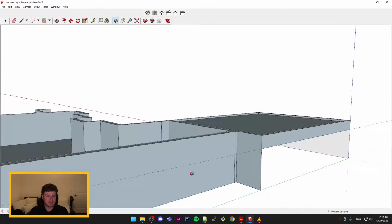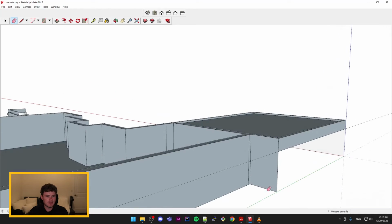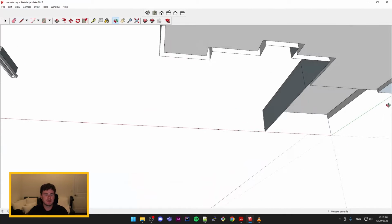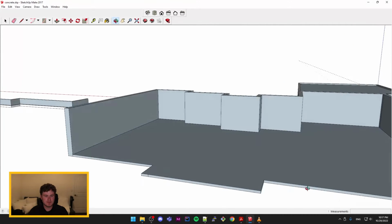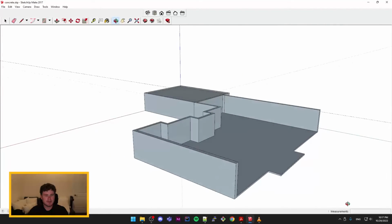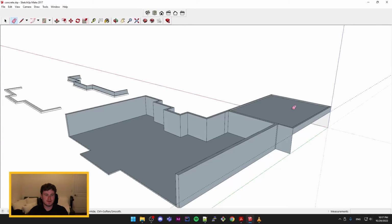And then at the very end, when we have all the concrete work done, besides the post holes, which I'll talk about here in a second, all of it should line up. So on the top, where the garage is going to be, the top of the ICF walls in the basement all should be at one level. And then we're also going to have a framed wall here. So along this edge here, there'll be just a 2x6 wall. And hopefully, my hope is that we get all of that done. So all the concrete work and this wall here and a few of the load-bearing walls inside, we get all of that done before New Year's, but I know that might be ambitious. So if we don't, I'm not going to be super bummed.